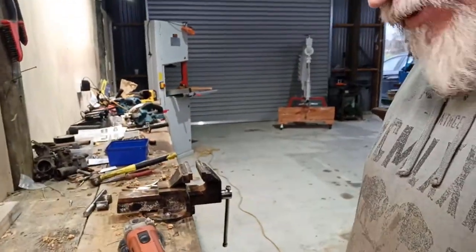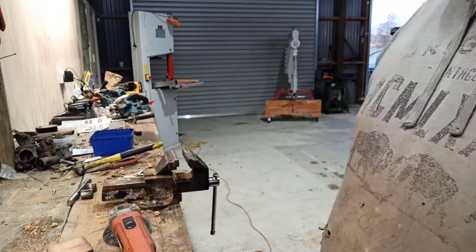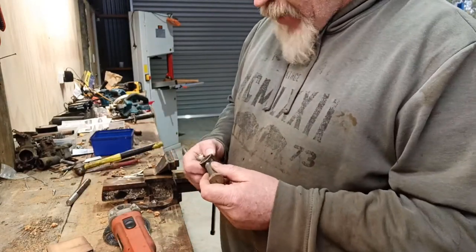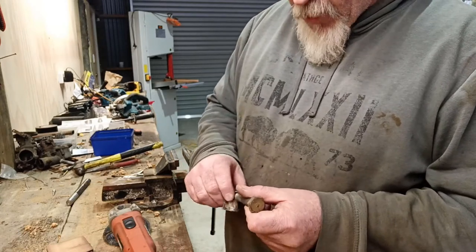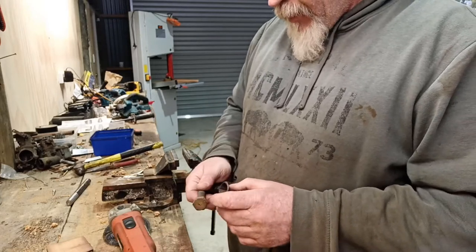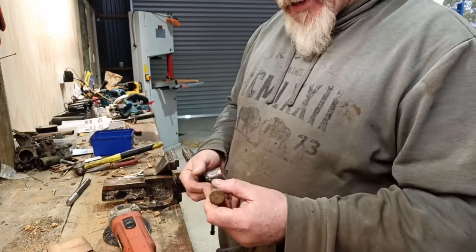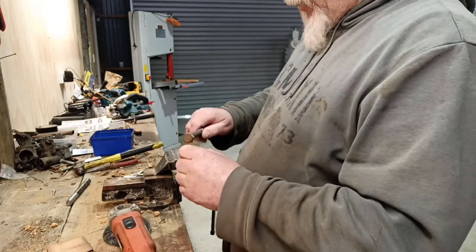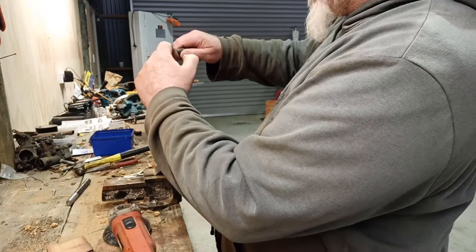It's getting later in the day, so I've just got back here. So I thought, screw it, since I've got gas here, I'll get this hammer half started or made up anyway. So I'm going to weld this one here and blow a whole heap of weld in here and make it nice and strong, hopefully. And then, whether I cut it and bend it down, or whether I just heat it up with gas and then bend it down, because I want it on, I wouldn't say a 45, probably a 30 degree angle.